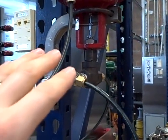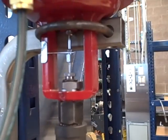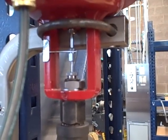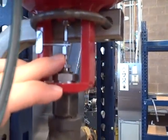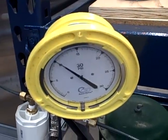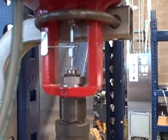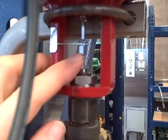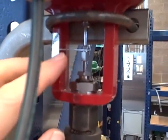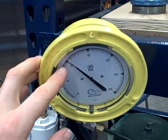Now I can adjust the pressure and we will see the valve move — a combination of feedforward and feedback control. If I turn this air pressure up, we're going to see the valve pinch off ever so slightly. It pinched off a little bit. I'm trying to maintain pressure inside here at roughly 10 psi. I keep increasing the air supply pressure, and the valve pinches off even more. It's hard to see the motion — it's very slight — but the valve did actually move down, and we're holding right here at the set point of about 10 psi.